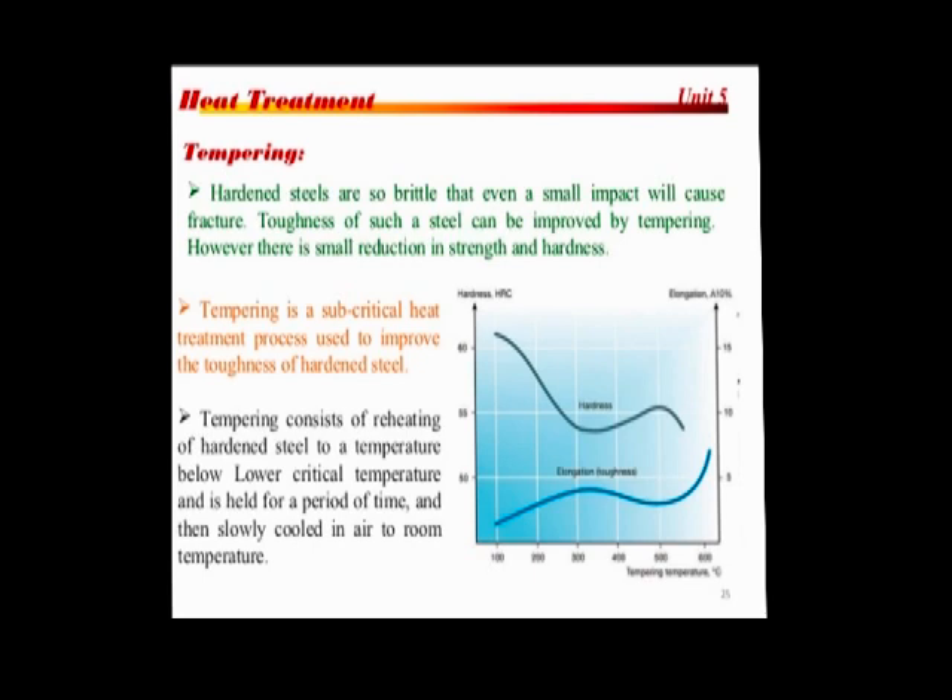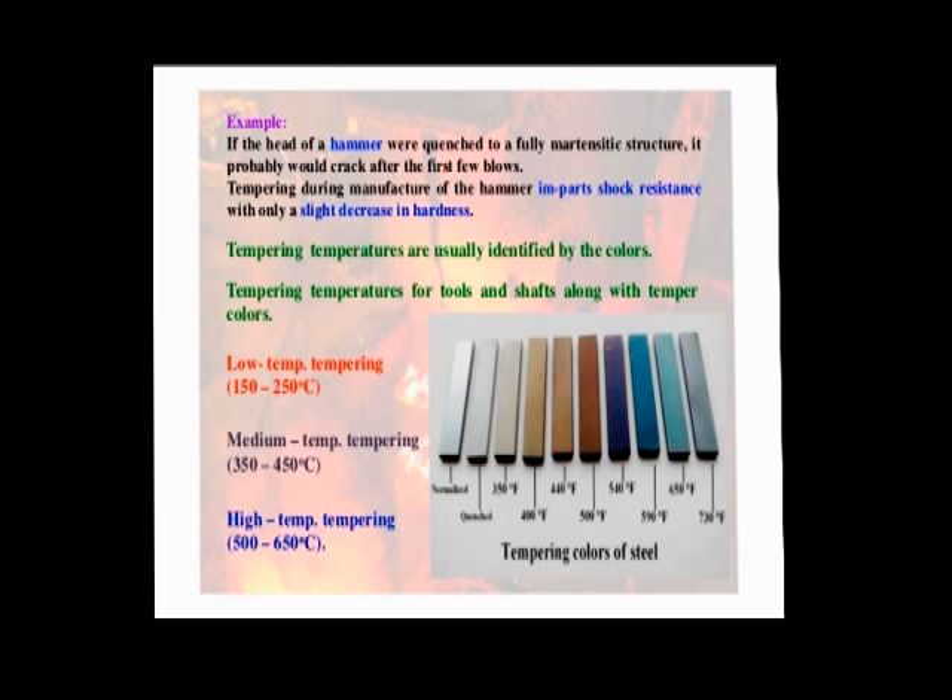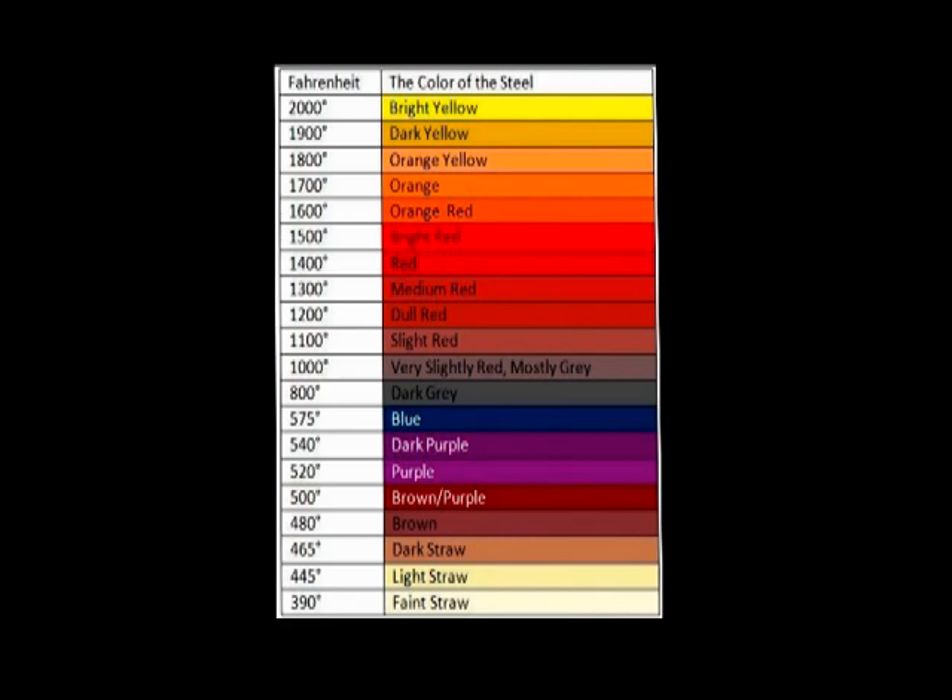For the optimal balance between wear resistance and toughness, temper between 262 to 288°C — this will produce 58 to 60 HRC. For maximum toughness, double temper at two hours plus two hours at a temperature above 510°C, which will produce a hardness of less than 58 HRC. To minimize internal stress in cross sections greater than 6 inches and to improve stability in tools that will be EDM'd after heat treatment, a soaking time of four to six hours at the tempering temperature below 510°C is strongly recommended.